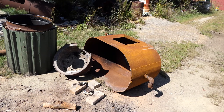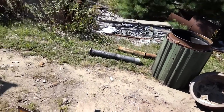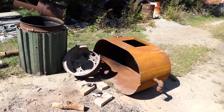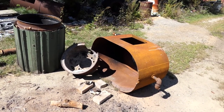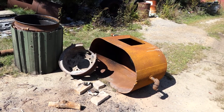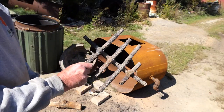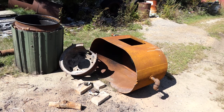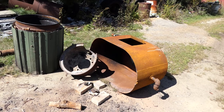I hope that helps. That's what we made it out of. Welding skills — I don't think it really needs too much except for the ring on the chimney, that's a pretty tight fit to keep it from sliding down into the barrel. You have to have the retainer there. I used the welder for that little grate, but everything else can be cut with an angle grinder. For you guys that don't have a welder, you could probably figure out something — you could just lay them on there. Just keep throwing in the wood, get that barrel good and hot, and have fun. It works real well. Okay, Hobby Logger's signing out. We're going to put this thing up for the guy there so he can go start building.